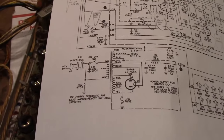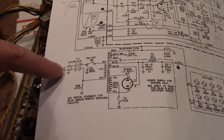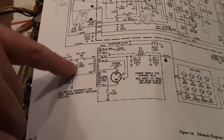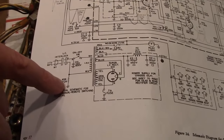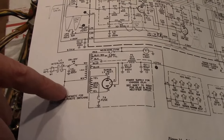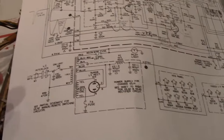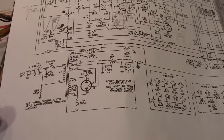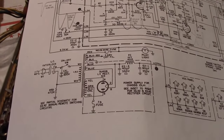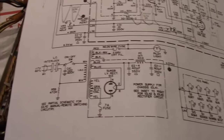If you're really concerned about safety, you could replace that with a polarized plug and have the neutral go to this side, because in case this ever shorts out — in case of the resistor failing — if this side was neutral, it wouldn't be a problem. But if this one shorts out, well, that being the hot side, that would be a problem. So if you're going to replace it, use a safety cap of Y-type. They are designed to fail open, never short out. Or take it out entirely if you don't have one on hand, because you do not want that to fail.